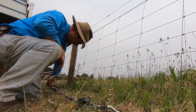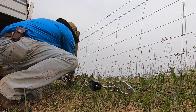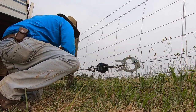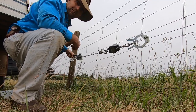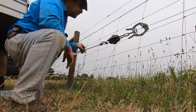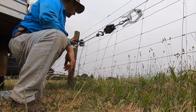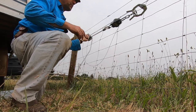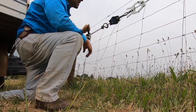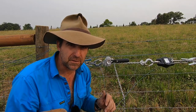Alright, let's wind her up and see what happens. You can also continuously wind around although I find that a bit awkward — it's easier just to use them like a normal set of strainers. There's a lot more levering than I'm used to. Normally about five or six pulls on the Haze-type strainers and I'd have this fence tightened up. But I suppose the big advantage is I've got the scale right here so as I'm straining I can be looking at it. The question now is will the bulk of these strainers get in the way when I try to tie off the straining knot.